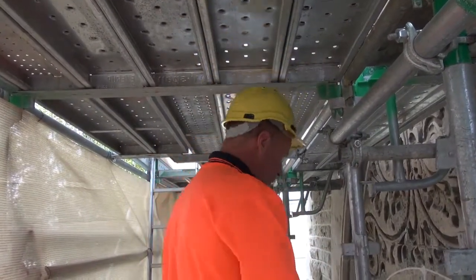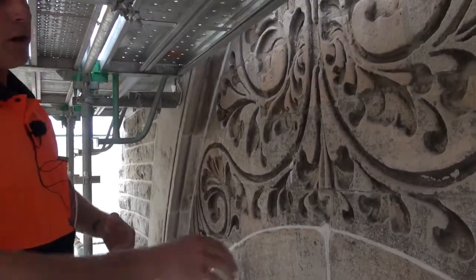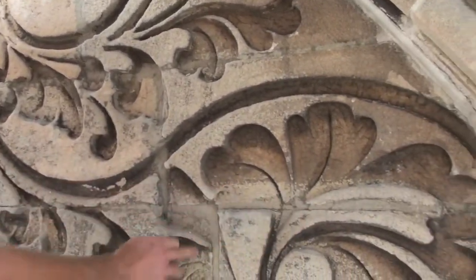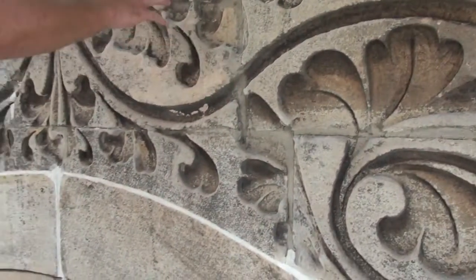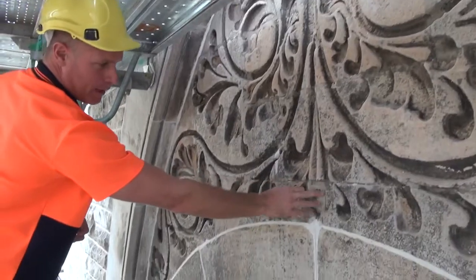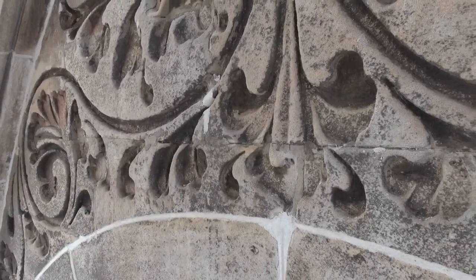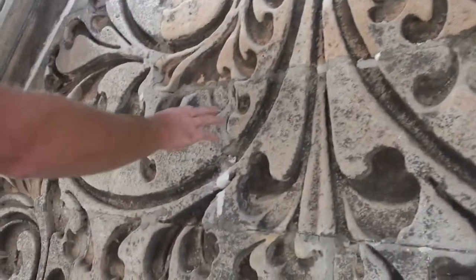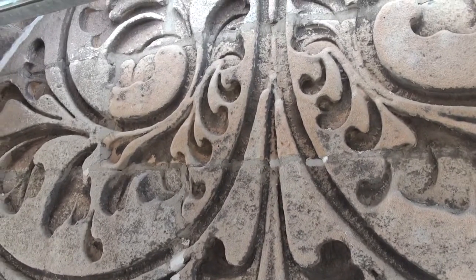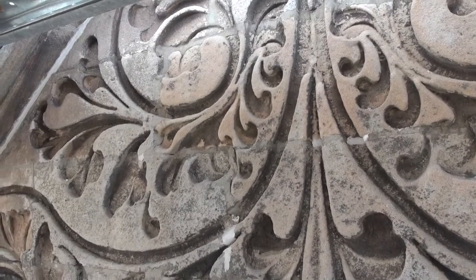If you have a look here in the detailed panels, the stone's quite soft. A lot of the details have all been washed away or knocked off by previous repairs. The stone itself is quite soft and very hard for us to work around. If we try to remove any of this, we'll create more damage than good. So we estimated in this area we leave it alone and just make it watertight.